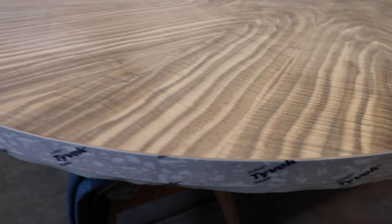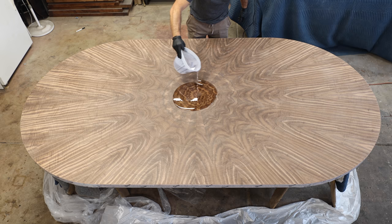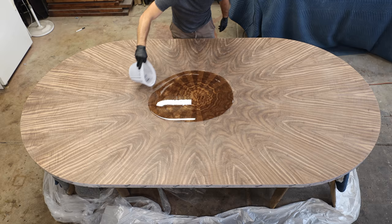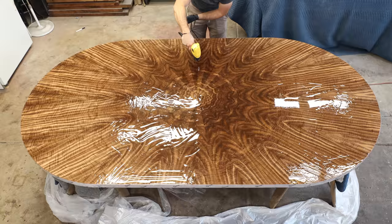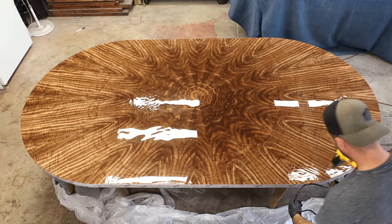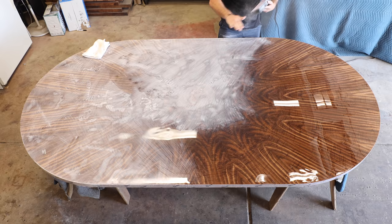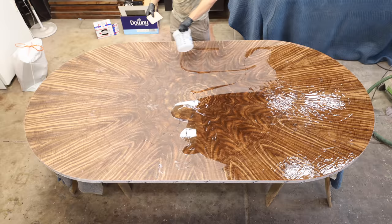I got the edge all taped off with Tyvek tape so I didn't get any overflow during the pouring process. Here's the money ticket — super clear tabletop epoxy going on for the first coat and it just brings the sunburst to life. One of the cool things about these pieces is GL Veneer hand-makes these in-house — they have a team of veneer experts that literally hand-cut these veneer sets and inlay them to look like this magical sunburst. Probably one of the cooler things I've experienced doing woodworking over the past eight years. I got my first coat laid out and had to use the heat gun to help level everything as best I could. It is actually really tough to get epoxy on this type of surface area perfectly flat, so I had to let it cure for a few days and then jump on block sanding to get all the high spots off. I started with 80 grit and finished all the way out to 320. When block sanding like this it's really important to go one direction and then the opposite direction after each pass — it really ensures keeping it as flat as possible.